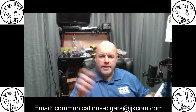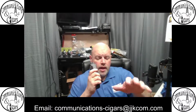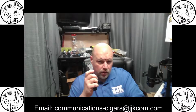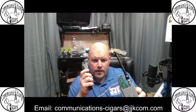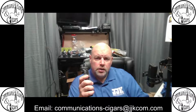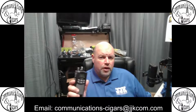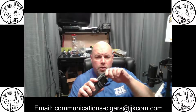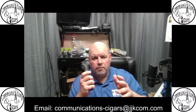In my car, I could take my P25 radio now, key up on my P25 radio, if I have a P25 capable receiver, and then go into the radio here in my car, which is like a little radio, like let's say this, or even another mobile radio, or however it is. And now my P25 can cross over to my Fusion radio, and I actually have that in there. So then that way, when I'm on duty public safety and I need to be able to listen to my stuff and I'm in my personal vehicle or nearby, I could just go ahead and switch it over to, oh, this is the simplex frequency I'm using, talk on P25 into my car switches over Fusion, and the Fusion sends it out over the air.